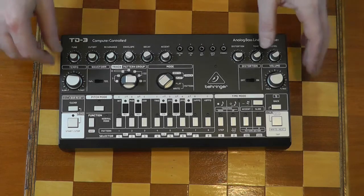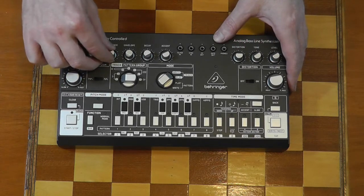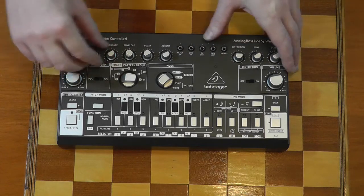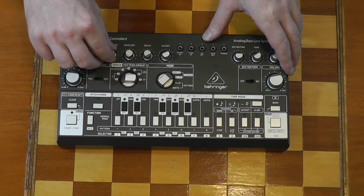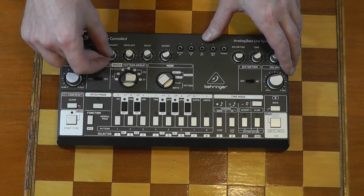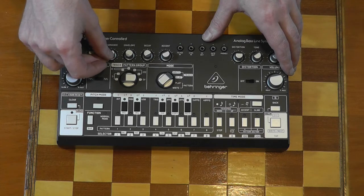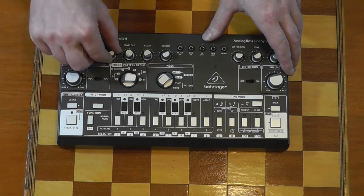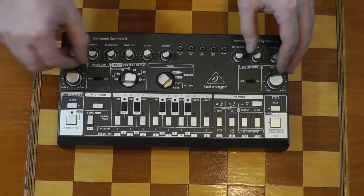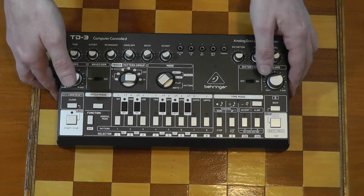Alright, so here we go then. Here's a little device. All the knobs feel quite sturdy. Now, the original 303 isn't actually that well constructed itself. Like the resonance knob and cut-off knob normally end up super wobbly because you can push them down into the circuit inside. Looks like you can maybe do that here. That's not so good. And they just basically wear out. They were all plastic shafted, crappy little pots on the original. So I don't know, we've probably got that going on again here.